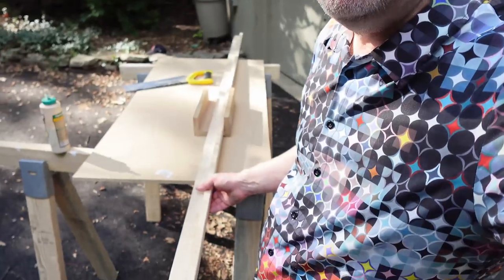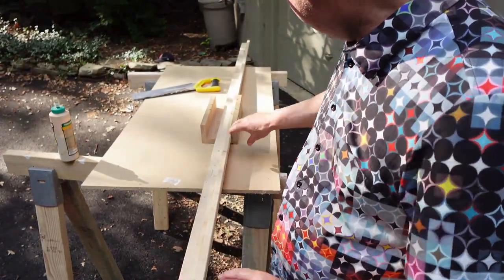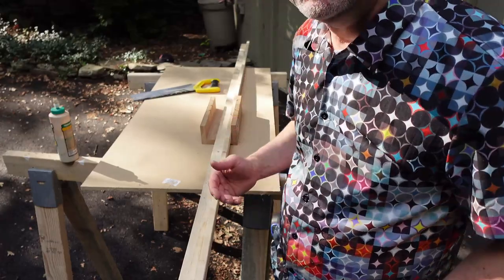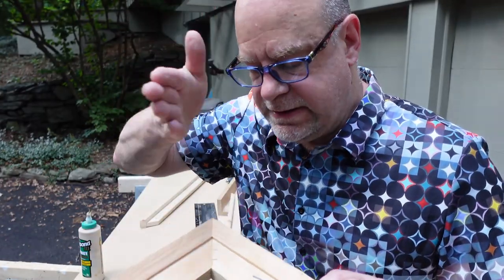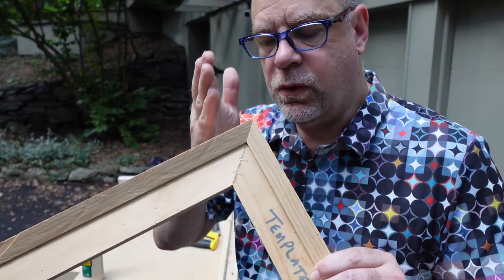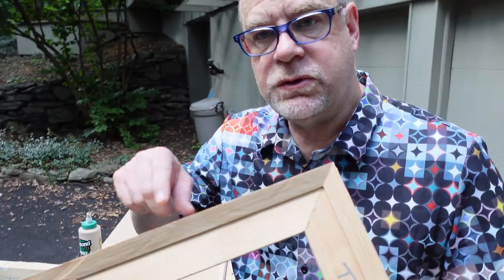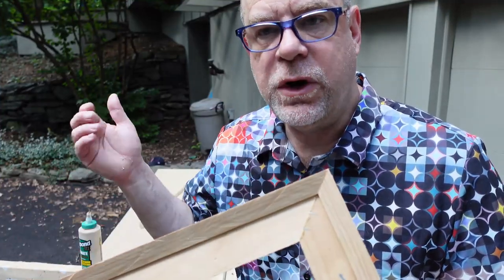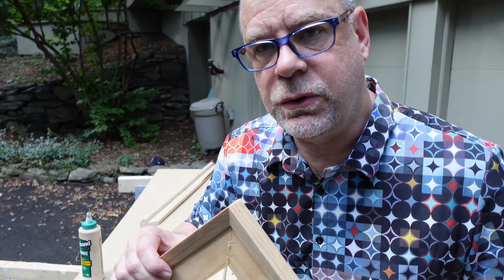One of the things worth mentioning is that when we are cutting, we want to make sure that our boards are lying in basically the same configuration we glued them — the wider strip lying down on the bottom of our miter box, with the tall part on the right-hand side. Now, a couple of words of caution: you want to make sure that the angles are being cut on the right parts of the wood. You want to have the high part be on the outside of your frame. Think about which part of the wood is going to be the outside of the frame, and that will help guide where your cut is. Also, when you are putting screws or nails in, make sure they're not going to be at the intersection where you need to make that cut — otherwise you're going to end up burning your saw blade through a nail or a screw. Not only is that hard to do, but if you're using power tools, it's kind of dangerous. So let's not do that.